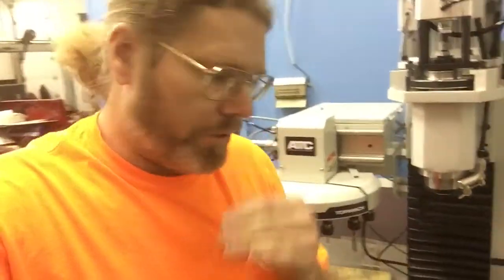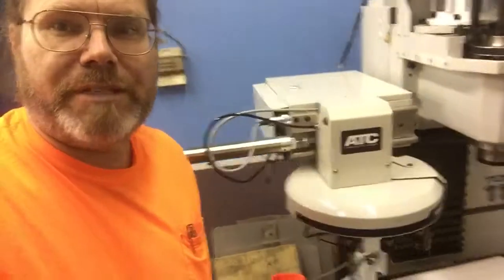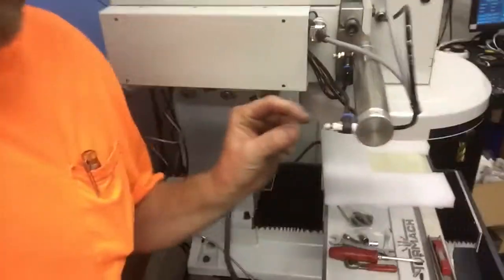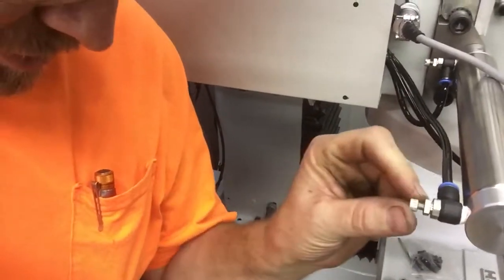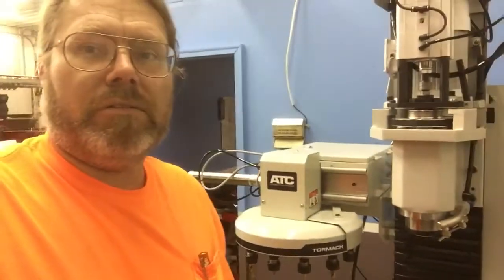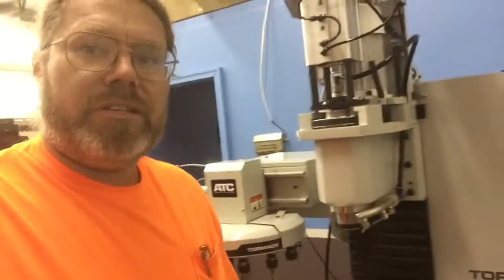After a lot of adjustments and playing with the ATC, I replaced the two forks that had gotten broken off by accident. They gave me a whole bag of replacement nylon screws. On the back here, you really got to take a look and take care of your application and release air pressure screws — they come turned all the way out. If the pressure is too high, that piston will move the umbrella at a very high rate and start chucking the tools out. I throttled them down so it's a little more silky smooth.